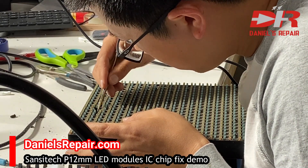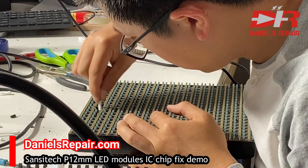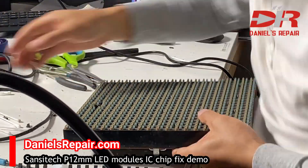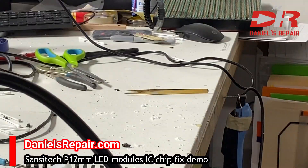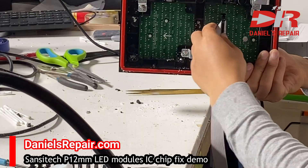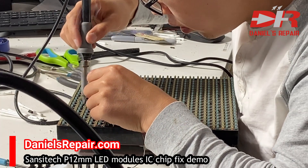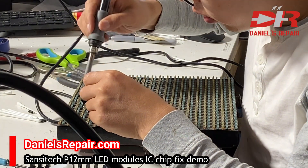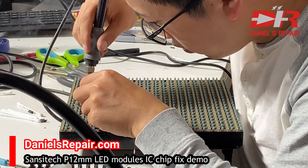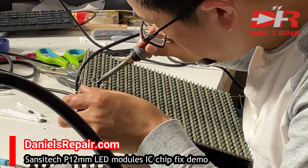This caused the bad soldering because during manufacturing, the silicone glue was in liquid form, so it seeped beneath the IC chip and became solid. After use for a year or a couple of months, it expands due to heat, causing bad connections between the IC chip pins. Some people try to repair just by resoldering the IC chip pins, but apparently this won't work for the long run.